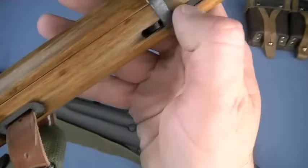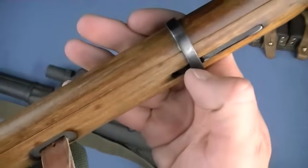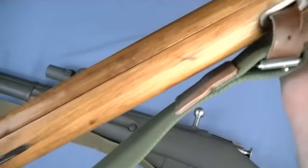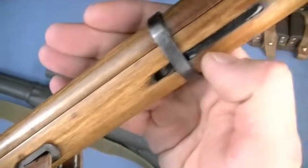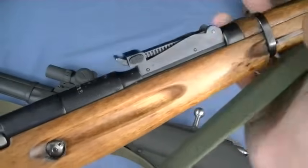By the way, in the stock, I hate to, this is so sad, this one broke. This is another modification of the 9130, by the way. Stamped hardened steel barrel bands instead of screwed on variety. Makes takedown a snap. And these are springs that retain them. This one cracked. Bummer. May replace it later. Those are the basic 9130 modifications.